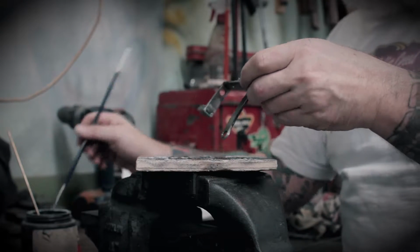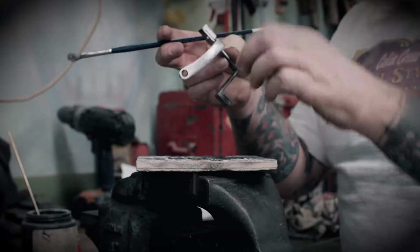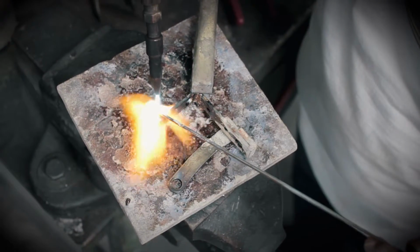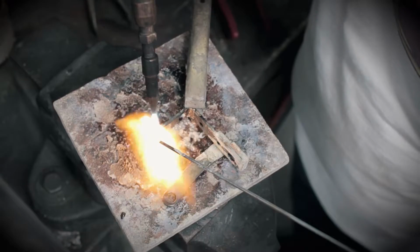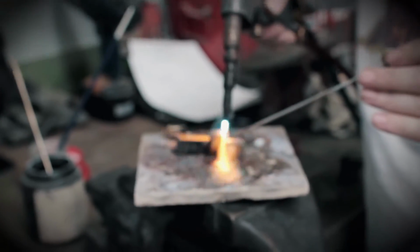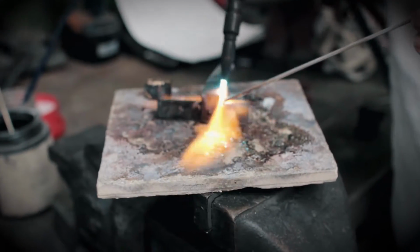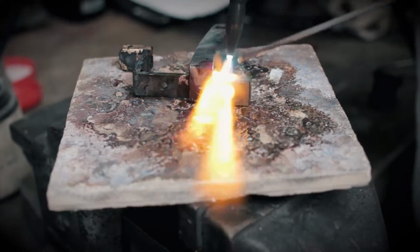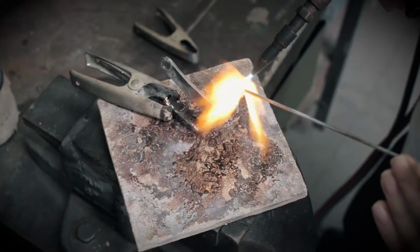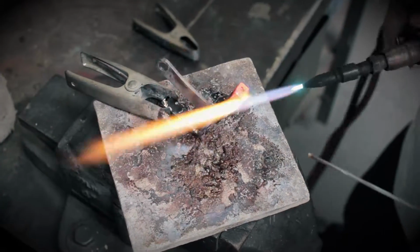With the steel points and voids cleaned, Colin applies a flux to the frame. This allows him to get into the corners easier when he's brazing. Colin's measurements are based on elements from other machines that he's created and owned. A particular style of machine might work really well for a particular purpose, and in doing so, you then use the old machines as your reference point, taking measurements and working it out.